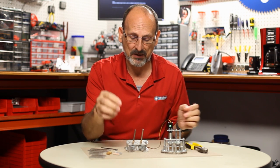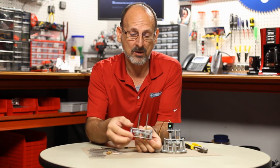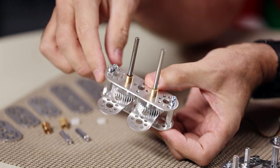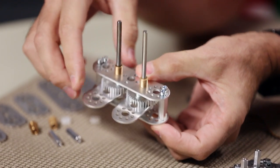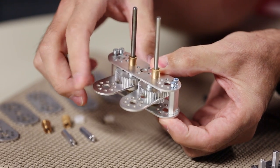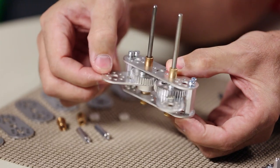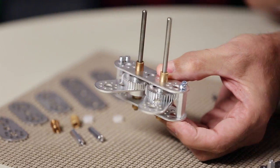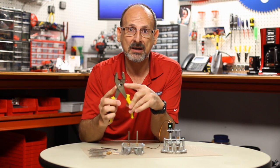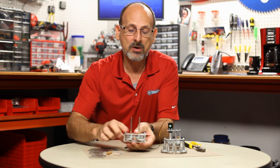So how would we do that in Tetrix? I've created a framework with two 96-millimeter flats, and I have two gears that are meshed together. When they're meshed together they create that common pivot point, and because meshed gears move in opposite directions, I have all of a sudden that same motion as a pair of pliers — a common pivot point working against each other — creating a gripper mechanism.